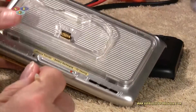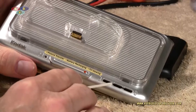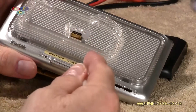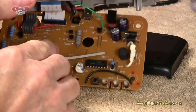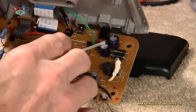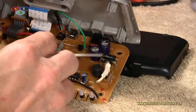For those who may not have watched that previous video - when I put my camera on this dock station with a brand new battery, after about 15 minutes the light will turn red and start flashing. That's generally an indication that there's a problem with the charging of the battery. These devices do use a linear power supply. Upon inspection of the board, this is where the power jack is - it does go through some filtration, and that's what these capacitors are.